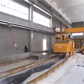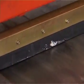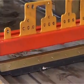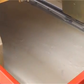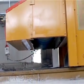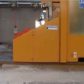Cleaning, oiling, steel wire laying. The first step in the production chain is the cleaning and oiling of the production bed, where concrete residue from the previous production cycle may still remain. Consisting of rotating brushes, the multifunction bed cleaner advances over the production bed, collecting the concrete debris in a container which can be easily emptied.